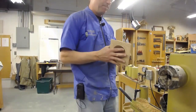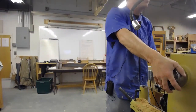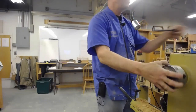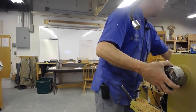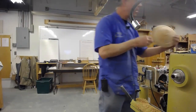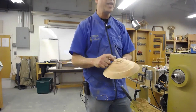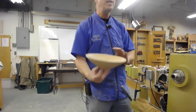Once I've done the carving, I'm going to sand that just a little bit. We're going to switch to the vacuum chuck. You don't have to use a vacuum chuck for these — you can always leave a foot on and finish it off when you're done, which is what I'm going to do. I'll leave my feet on, everything will be done, and the bottom of the bowl will actually be natural cherry. I found that a lot of people at the craft fair really liked that — they could pick it up and see the raw wood there no matter what finish I had on it.